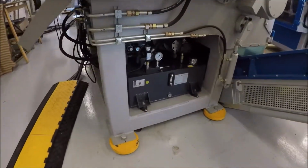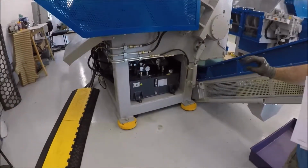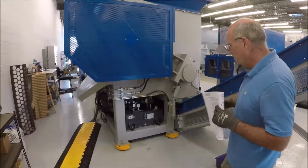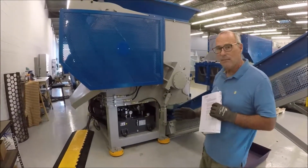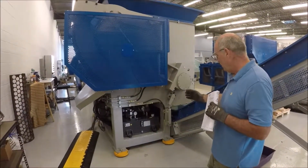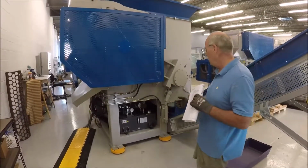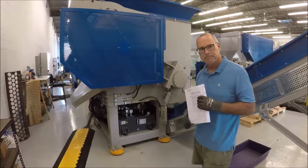And it's important to always maintain your hydraulic fluids and clean your filters on it, because hydraulics are such an important part of these machines, and they really get worked hard, especially in the summer, to prevent any heat ups or deterioration of the system when it gets hot and humid within your facilities. There you go.